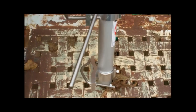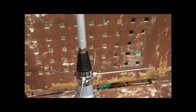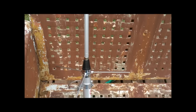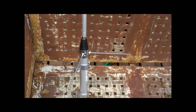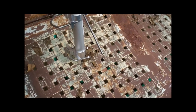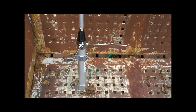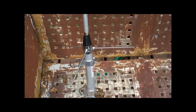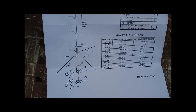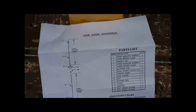It's actually really well built — I was surprised given how inexpensive it was. That was another reason I decided to just go ahead and buy something. Like I said, I wanted to get something up quickly, and building my own was going to take a long time — I'm just not fast at it, and I've got some health issues that often get in the way of doing stuff like that. This was only just barely over forty dollars. It's a five-eighths wave and it's rated in dB gain over a quarter wave — I think it was four or five dB over a quarter wave.